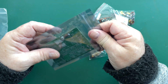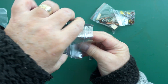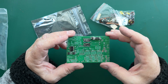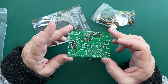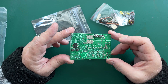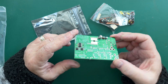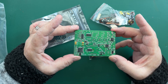Here is the actual kit itself. As usual, the surface mount has all been pre-populated on the board, as well as this little section here which is relatively new. There's a switch mode supply which really cuts down on the amount of current being wasted as heat — there's a really good video on the QRP website about that on YouTube. This is a revision 5 board, and as you can see there's quite a lot of surface mount on here.